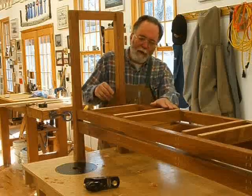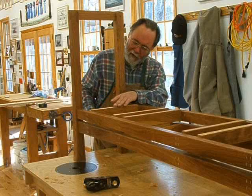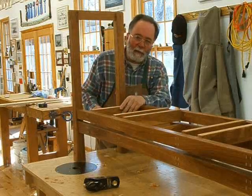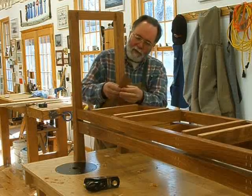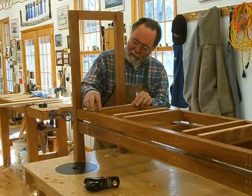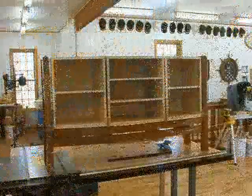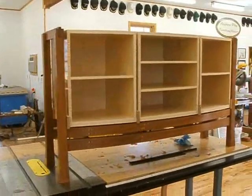Now I've gotten through planing all of the cross pieces that hold the carcass boxes, and I found that this very last cross piece is just a little bit low. Rather than plane down all the rest of the cross pieces and fiddle with that for hours trying to get them all level, I'm simply going to shim up this cross piece using a couple of pieces of cherry veneer scrap. I'll glue down these two layers on here, and after the glue is set I'll trim it up, hit it with a little finish, and we'll be all done.